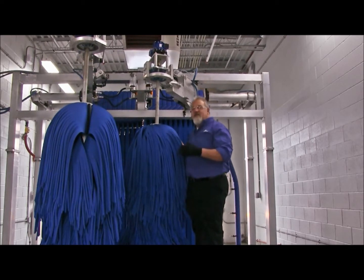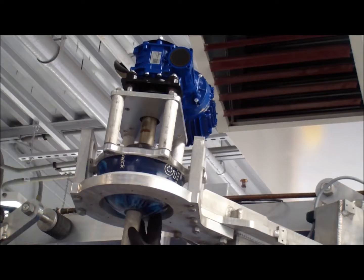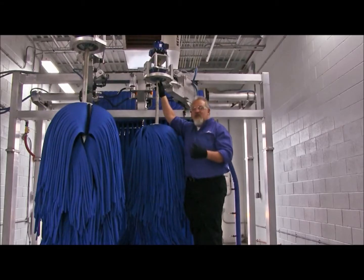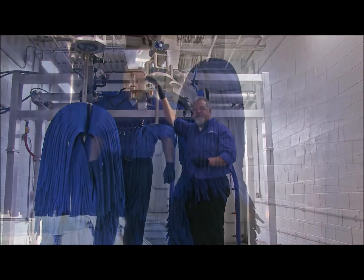So any excessive grease you see on any of your gyro bearings, go ahead and take a rag and remove that. Now, I want to talk a little bit about the actual bowling ball of the gyro. The bowling ball allows the brush to swivel 360 degrees. As part of that zone 1 assessment of your gyro, give a good visual inspection of that bowling ball. Make sure it doesn't have any nicks, chips, or cracks in it. If everything looks great, go ahead and move on to the next part of your assessment.